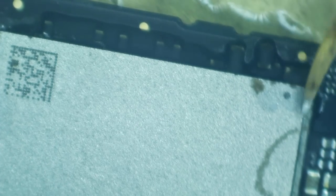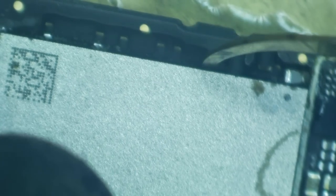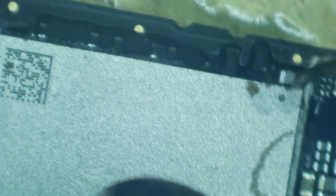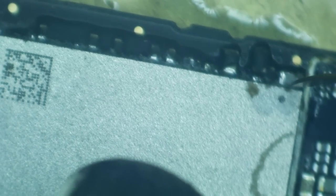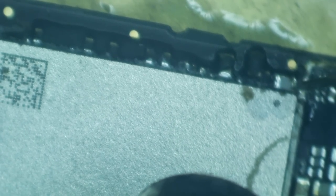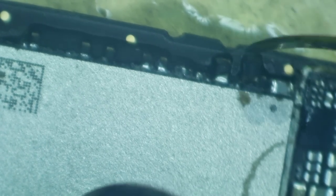You know, there are actually odds that removing of that shield up top without using low melt or anything could have caused a problem with the CPU. Not like damage the CPU, but actually caused it to disconnect. And that's why we're sitting here with a low amount of power and the thing's not going any farther. We're just going to swap this thing over to a known good board and I really don't like having the variable of not being the identical same board, but this, get out of my way, you little resistor, or whatever, should not matter. Shouldn't, right?